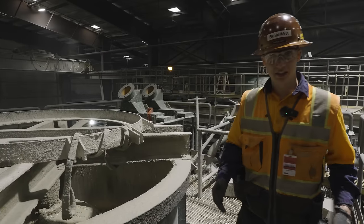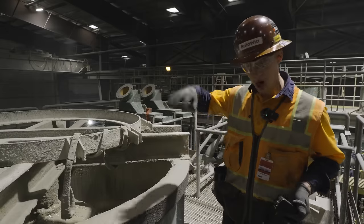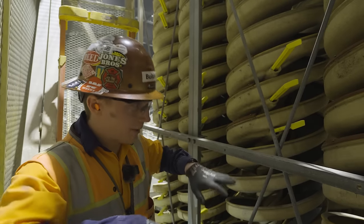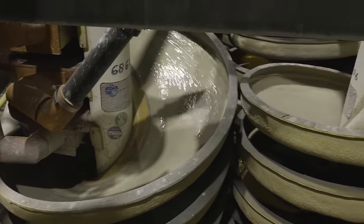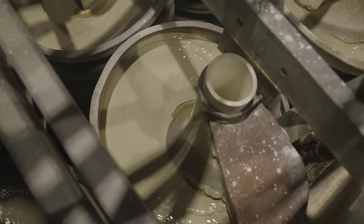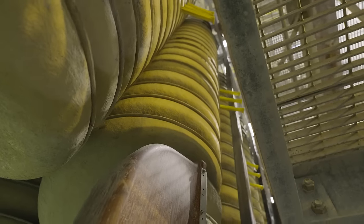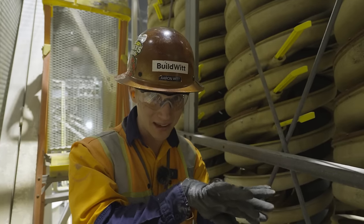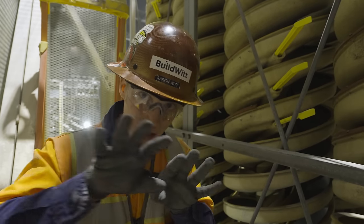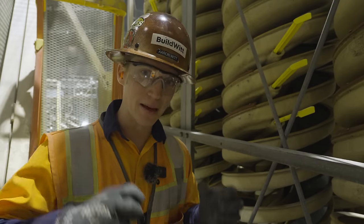After the screening process, we have a really fine slurry that's pumped up to the top of the plant — about four or five stories up — into a distributor. The distributor then sends it to the next part of the process right below, hitting these spiral columns that look like giant shocks but are actually slides for the gold and the rock. Because gold is heavier than rock, you can spin it to separate the two. As material slides down, the worthless tailings go to the outside while the gold stays to the inside. Running it through a few times separates the waste and collects the gold, which then drops to a shaker table for final cleaning.